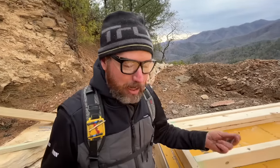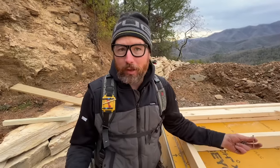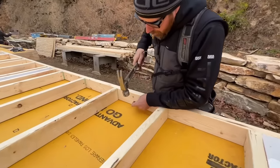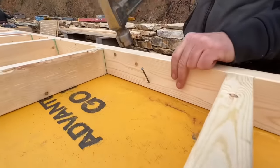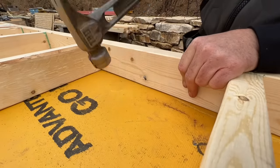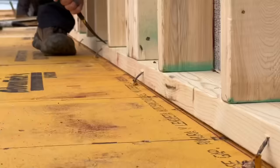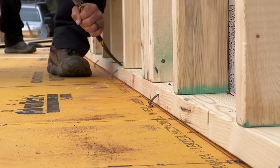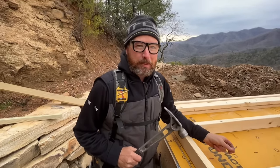We like to chalk a line and pull the plate down to that line, then tack it to the floor with toenails that we can peel off so that it stays put and straight. These also work like hinges — when you stand the wall up, it doesn't slide off the floor and fall. You might even say that doing this step right here is pivotal.